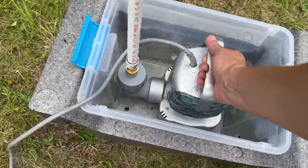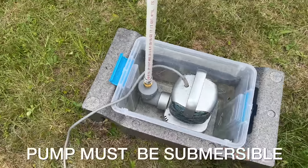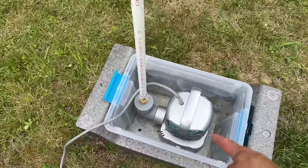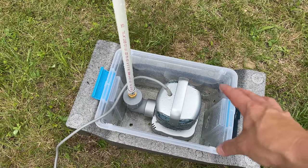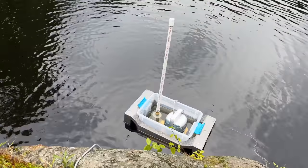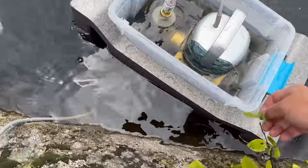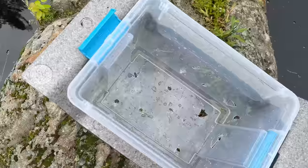This simple design is going to work great with pretty much any type of utility pump. But if your pump is small, you may not be able to power a stack quite that long, so you can adapt this to fit your own needs. The reason you want to have this pump floating on the surface as opposed to the bottom is that if you put it down there, it is going to be getting clogged constantly. By floating on the surface, you're very unlikely to pick up any kind of debris.